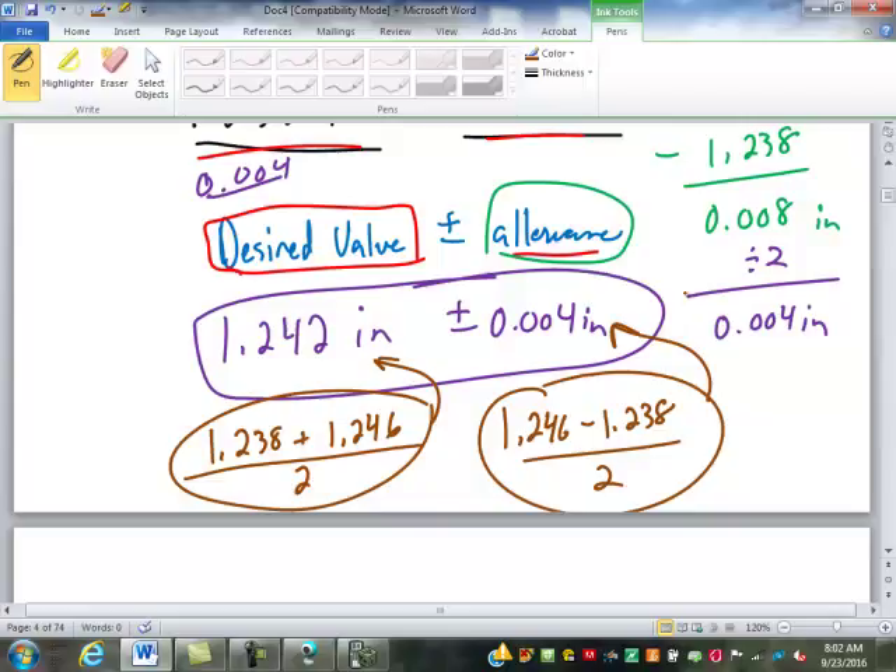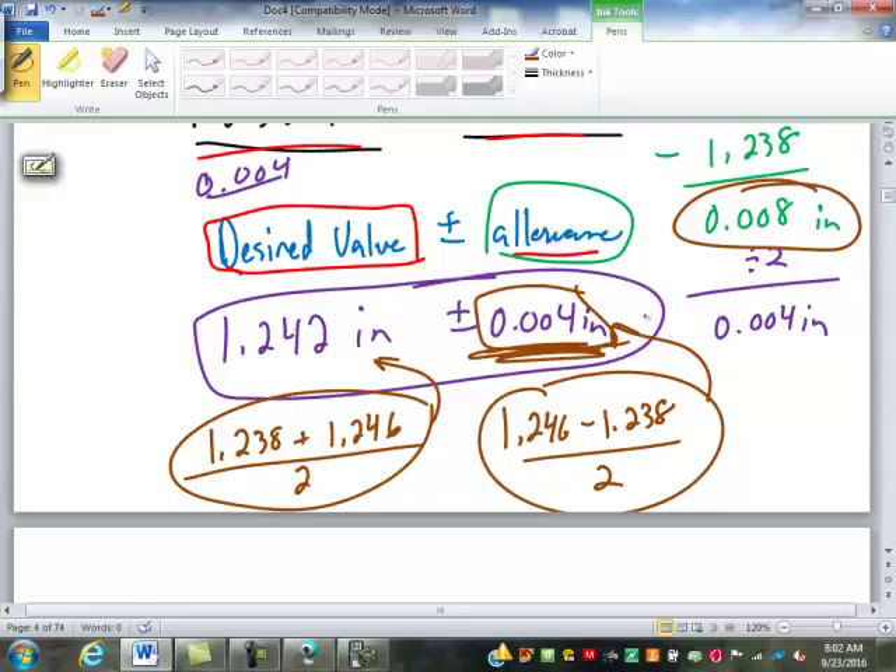Any questions? An allowance is the plus or minus. The tolerance is the whole range between the smallest and largest. In practice, a lot of people refer to this as a tolerance, so you have to be careful about what they're referring to. Have you covered anything like that in blueprint reading yet? We're going to keep calling the whole range the tolerance in here for now, but technically in the textbook when it asks for the tolerance it may be the full range — double the allowance — so you'll know why when you check your work.